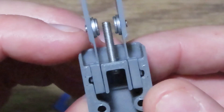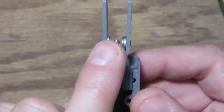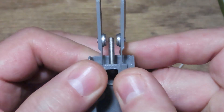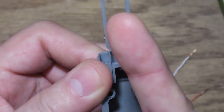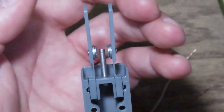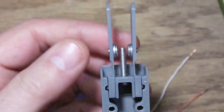The other note is this center screw. These screws are almost always slightly bent in one direction - you'll see that when rotating the screw the gap will get wider on one side and thinner on the other. When you get to assembling the whole thing with the paddles properly shimmed, you'll want to slightly rotate that center screw and watch closely. You can adjust that screw until the gaps are identical on either side. Once you've got the touch that you want, you can get that gap really small for a nice light touch, or make it a little bit wider if you want to push just a little harder.